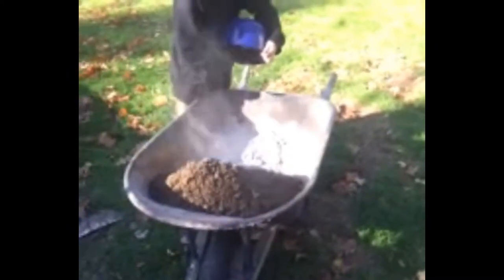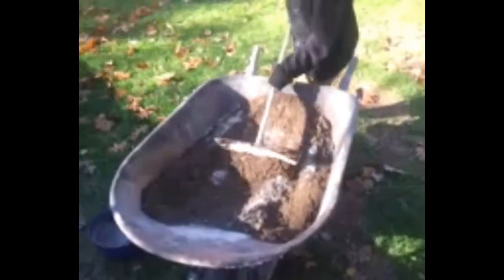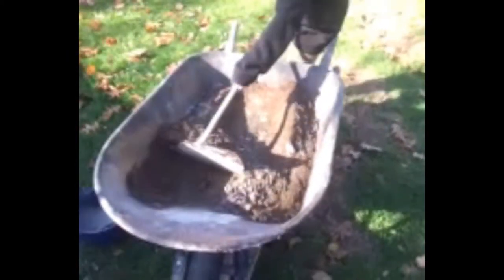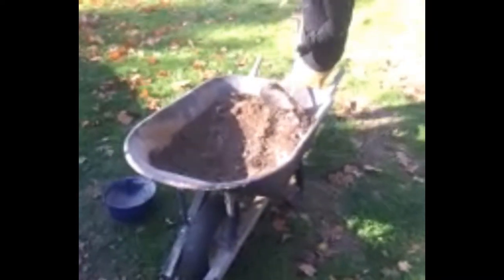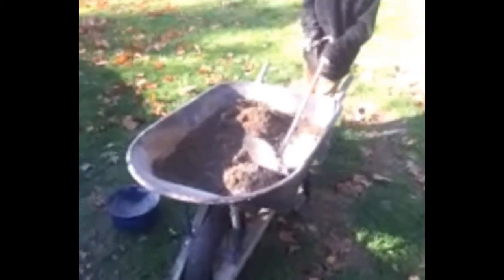Okay, you mix it up a little bit. So we will just mix it up dry. Ideally, I'd like to have a pile of sand, a pile of half-inch clean, and just do three parts rock, two parts sand, one part cement. But in lieu of that, we just got some gravel from Buddy's pile and we're just doing five parts of gravel and one part cement.